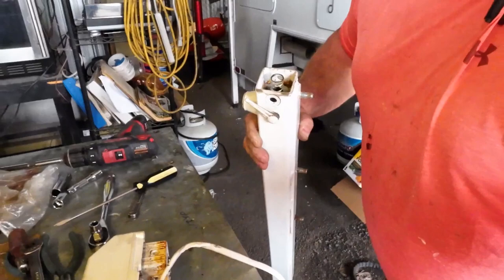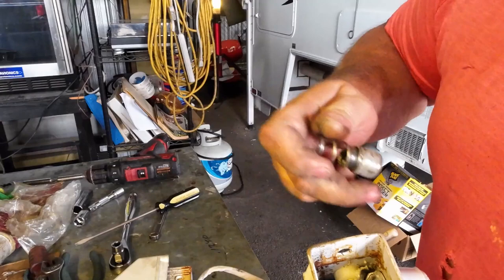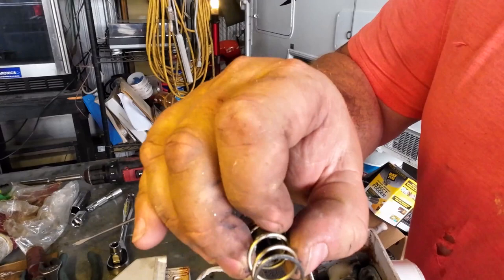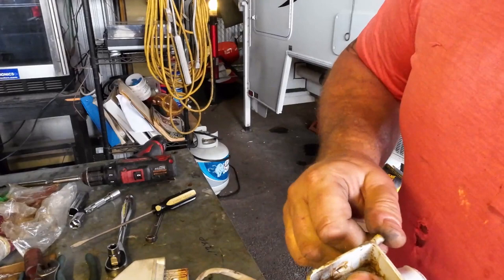If you guys have ever seen how this disconnect works — this is just disconnecting the motor right now. With the lever up engaged, this coupler shaft is engaging on the motor. The motor slides into half of this, then the other half goes over the top of the ball screw. When you push this lever down it just disengages the motor, so now the motor can spin freely up here on the top. You put that pin back and it'll spring down and engage — that's what that guy's doing.